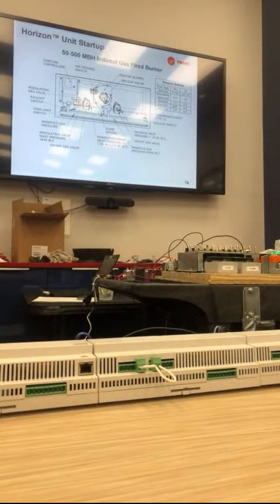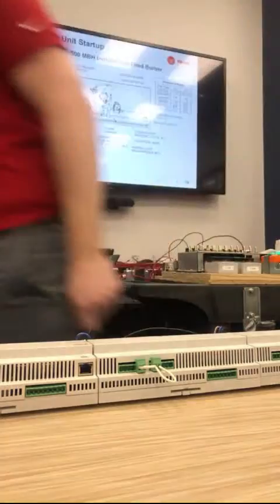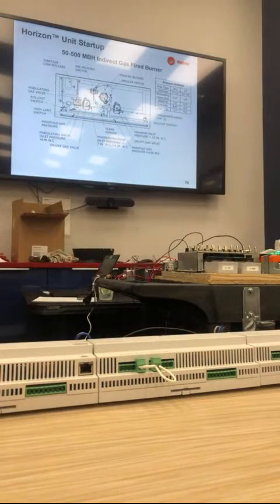In addition to that, this is why we recommend a turn before installing the discharge air sensor. If you were to install a discharge air sensor on this side, once that second stage comes on, it looks like your discharge temperature just shoots up. So we'd like the ductwork laid out so the air can mix before you read your discharge air temperature. We like to see a 90 after the unit, and then 4 feet down the ductwork for the discharge temperature sensor.